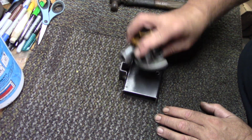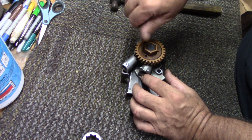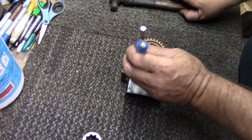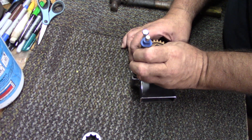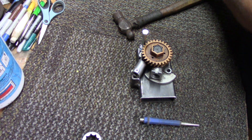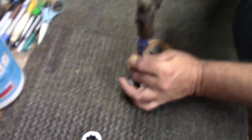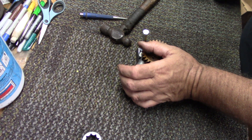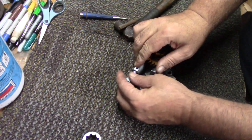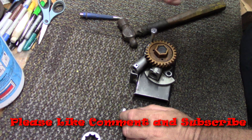I've got this little jig I made up. I take that rotor out and it sits in here, supports this little thing here. I've got a bolt that I put in here just to make things stay in place. Then we're going to take a drift punch here — I'm going to start that down out of there. I have a little thing I made, just a cut-off bolt with a notch in it. I kind of hold my hand across the end of it and use a narrower drift to drive that out of there.